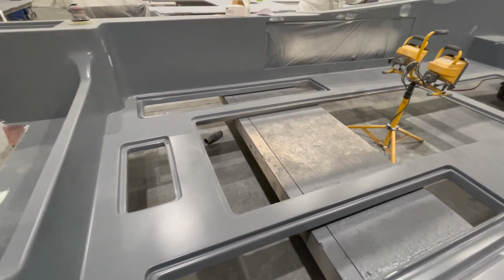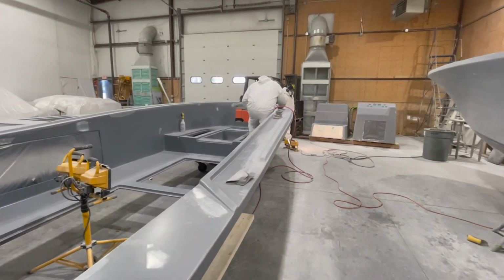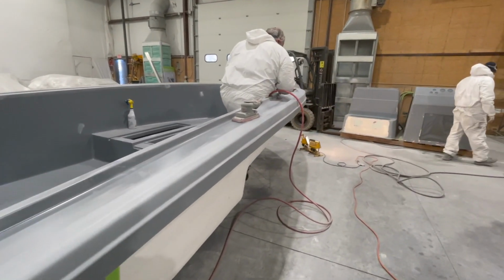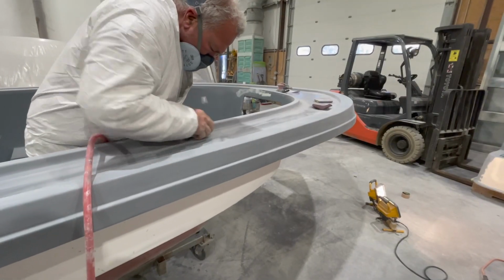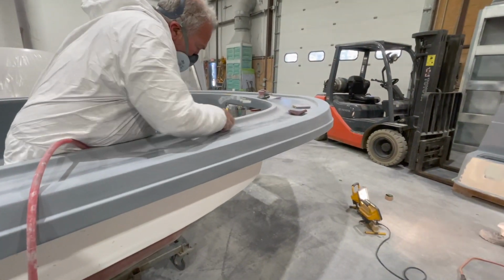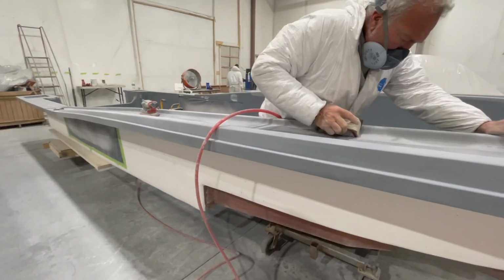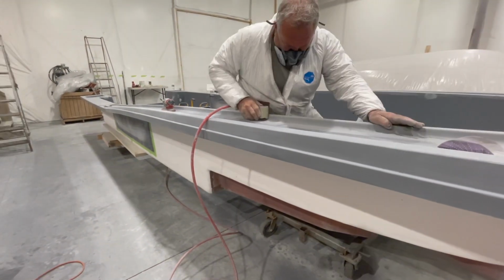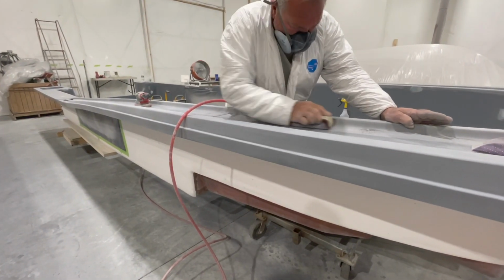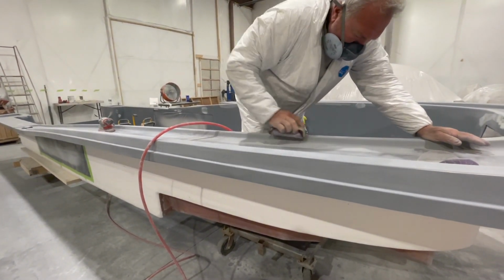these different little imperfections. Absolutely the most important part of the job is right here. Whether you're in final primer before paint or final Duratec before gel coat, this is it. This is where all the body work pays off, but you can't dig, can't gouge, can't make a move, can't make a boo-boo. Stan, 64 years young.